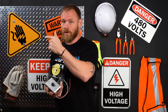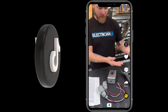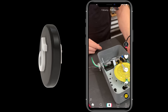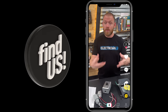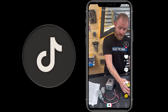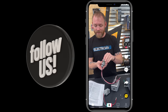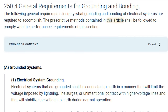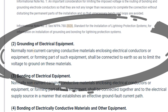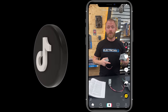When you're working with photocells or time clocks, always be aware of what you're working on and still go turn the breaker off. You may wonder why some things don't have grounds — like these photocells have no green wire — while other devices do. The reason is: if something has a conductive metal surface you could touch and get electrocuted, you have to ground it. Anything plastic that doesn't allow you to get shocked doesn't need a ground wire. NEC 250.4(A)(2) states that normally non-current-carrying conductive materials enclosing electrical conductors shall be connected to earth to limit voltage to ground — it applies to metal enclosures.